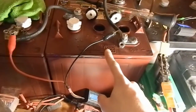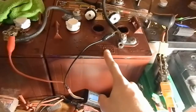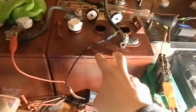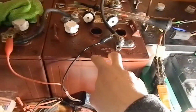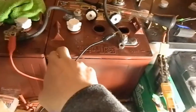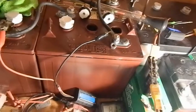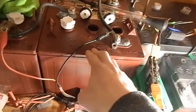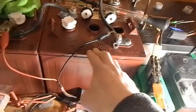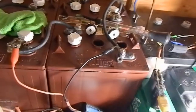I had this battery on equalise today for over two and a half hours. I can only get it to go up to just over 1.27 specific gravity, while these two cells here are at 1.28 — so that's a fair difference. I don't know if I'm going to be able to fix this cell. I'll leave it on equalise a bit longer and see what happens, but the rest of them seem to be fine.